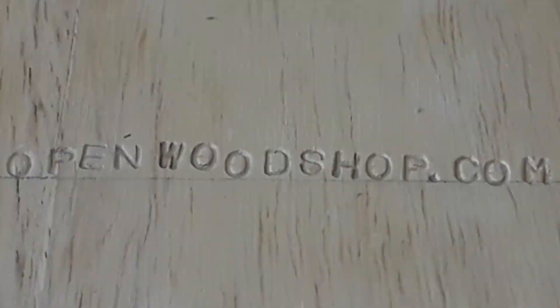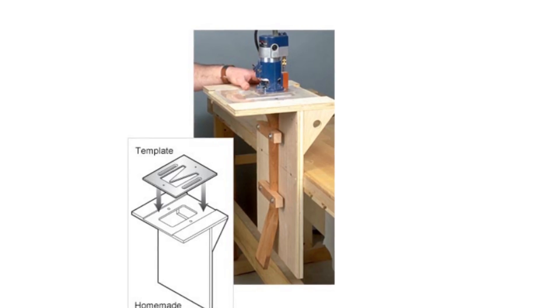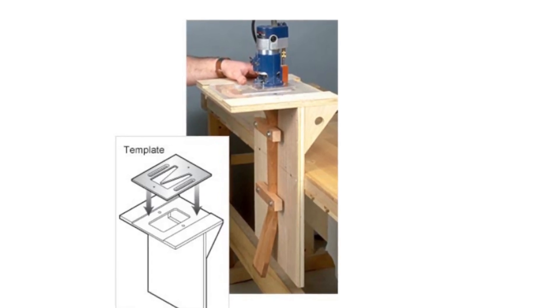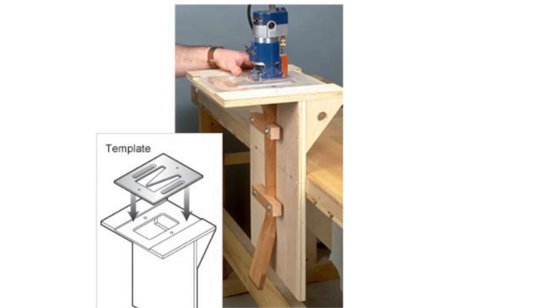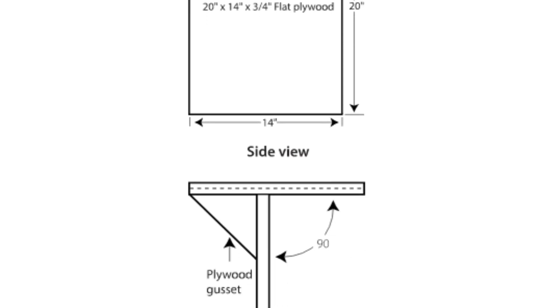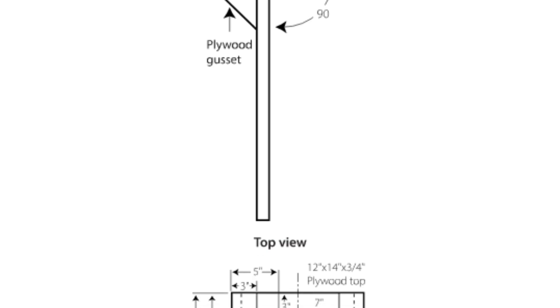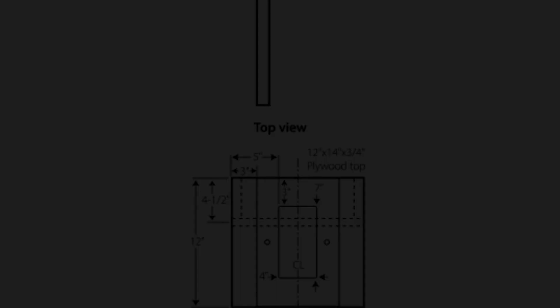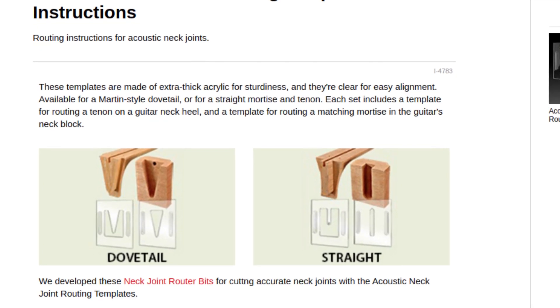What I've been working on lately is a jig that I've wanted to build for a while. I'm not sure exactly what to call it, but StewMac.com calls it an acoustic neck joint routing jig. I'm building it to make the mortise and tenon joint that joins the neck and body of a guitar together, and I think there may be some other uses as well. Although I've had the basic idea in my head for a long time, when I saw the free drawings on the StewMac website — I'll post them in the comments below — I decided to go ahead and just build theirs.